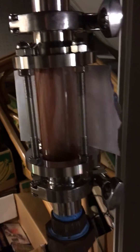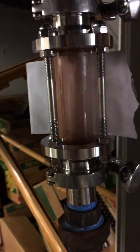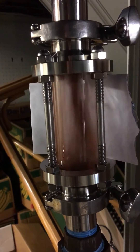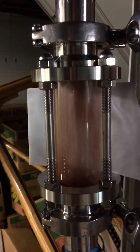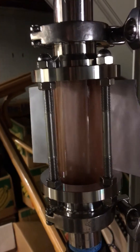It's pushing a ton of boiler water through my main — look at it. I've got some Rector Seal 8-Way in there, which is why it's a little purple-brown. But why is it pushing so much water through?